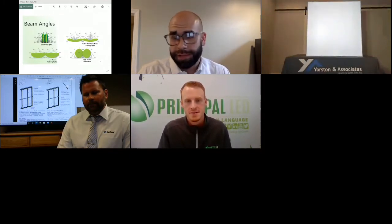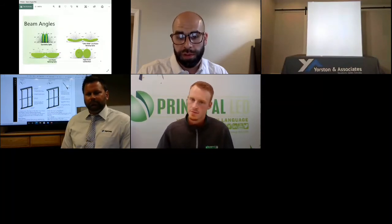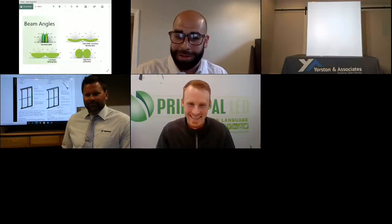I don't think there's a learning curve for that, but you say, listen, if you have been required by engineering to have a pole that diameter in the ground, have that pole taper, right? Taper. If it starts as 6, let's see if we can taper that down to a 4 inch pole. That's really going to help us out. Exactly. Or figure out another mounting provision or make the cabinet deeper. Sometimes we say yes to the customer, right? In a certain application, can we put this 6 inch deep cabinet on this 6 inch pole? Well, sure, I'll figure it out. And then it's like, oh, I have this great dark line in the middle of my sign. It's like, yeah, that's going to be there. That just is what it is, right?